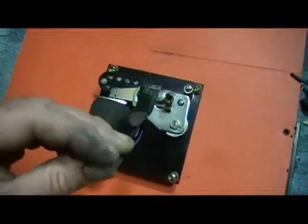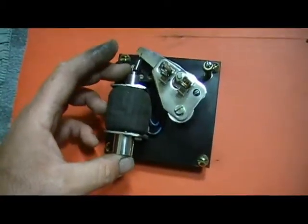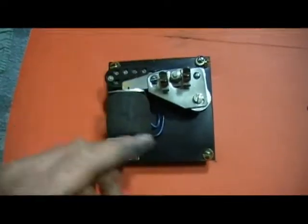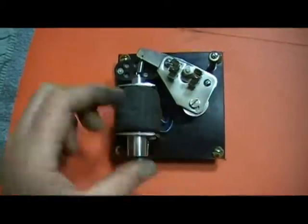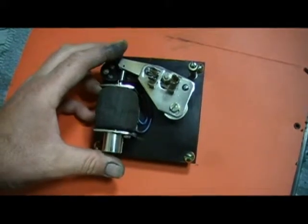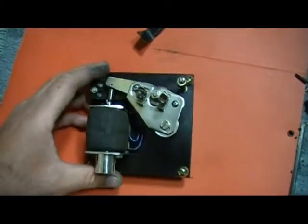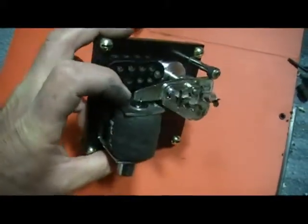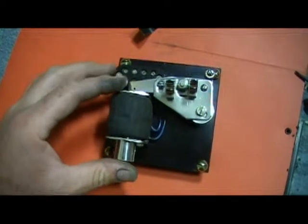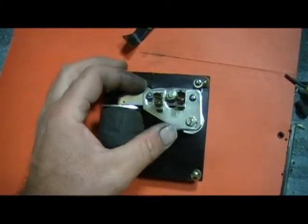Now, this modification that we talked about earlier — I'm pretty sure it was put in because the washers on the plunger had gone and it was causing it to go up too high. If this is a 24-volt AC coil, if you give it a decent whack of 24 volts, it will probably jam in the middle nicely. And that's what the spring is for — to stop any splash of the mercury. We won't know until we test it, but I don't think that modification is needed anymore. So we'll fire it up tomorrow and see what she does. I'm not going to put the mercury switch back on until right at the end — it's a very valuable piece of kit — and at the very last minute the mercury switch will go back on.